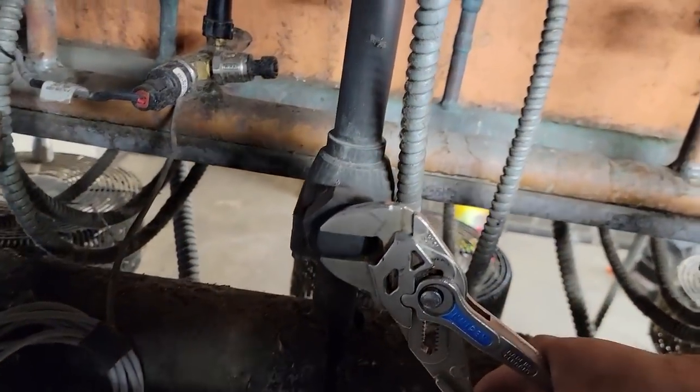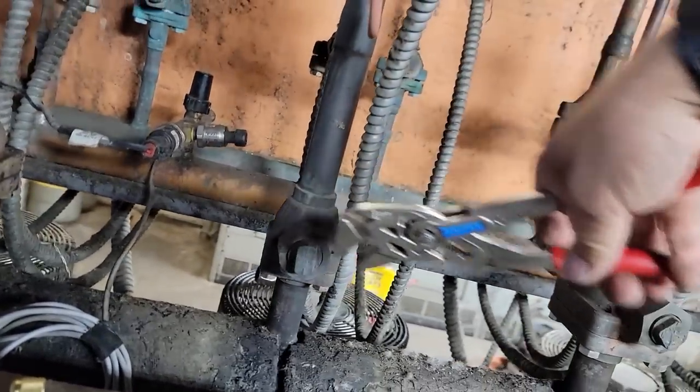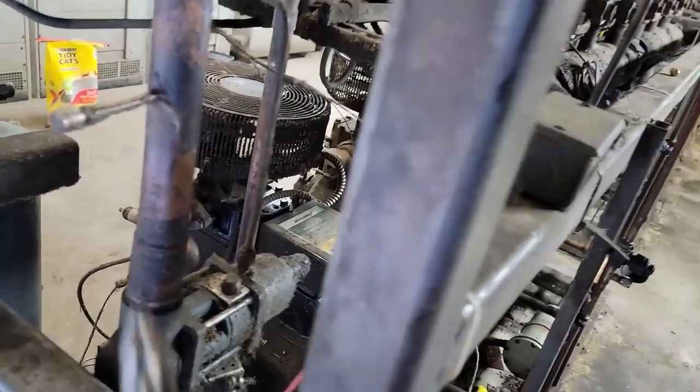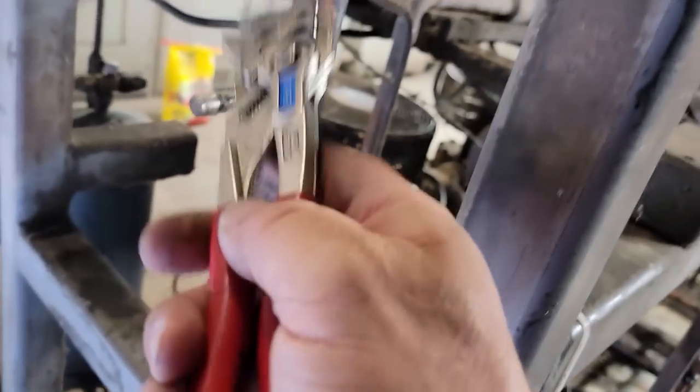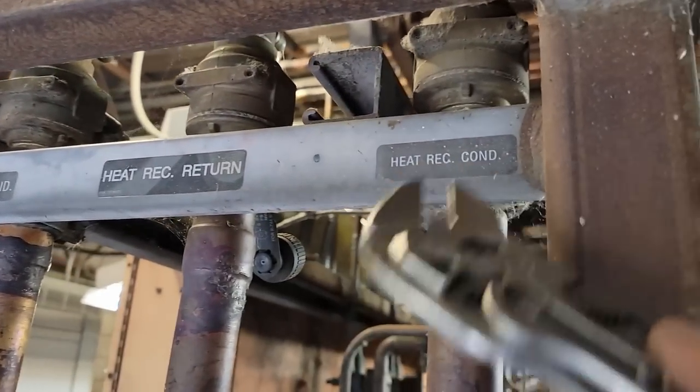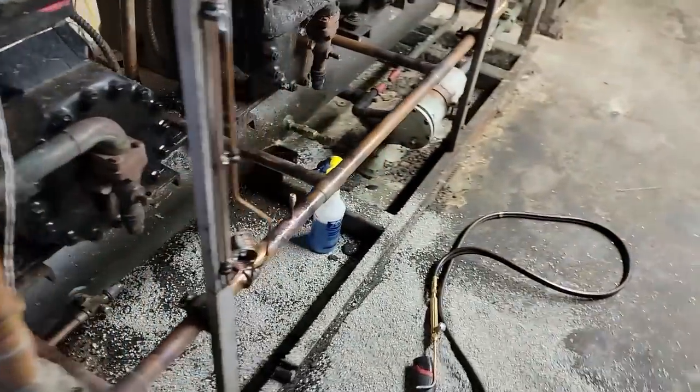It's awesome with these pliers, even though that's backwards, it has the strength to do it because it has such down pressure. See, somebody else did the same thing I did here. That one there, because they must have had to do a relief in between there, or actually so you can pressure check. Actually you got pressure ports up there on top too. This is your three-way valve, so you got normal condenser, reheat, and normal condenser. So for wintertime, you get reheat out of it.